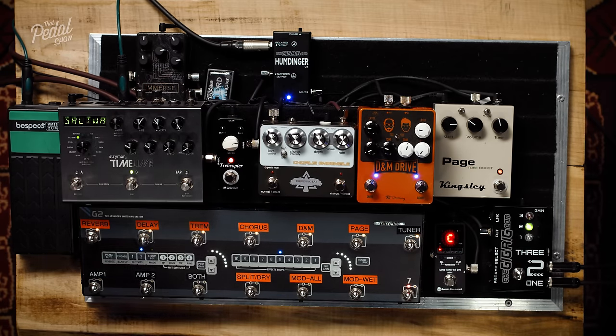It's a pain. There are ways around it, but if you're not using a switching system, if the pedals aren't in a loop, it actually requires a mod to the pedal to reverse the phase. Because the reversing of the phase has to be done at the end of the circuit before the switch. Okay, so it's only out of phase when it's on, right? Exactly. So it's out of phase when the circuit is in line. Yeah. So you need to reverse the phase at the end of the circuit before it hits the switch. So there are ways to do that, though.